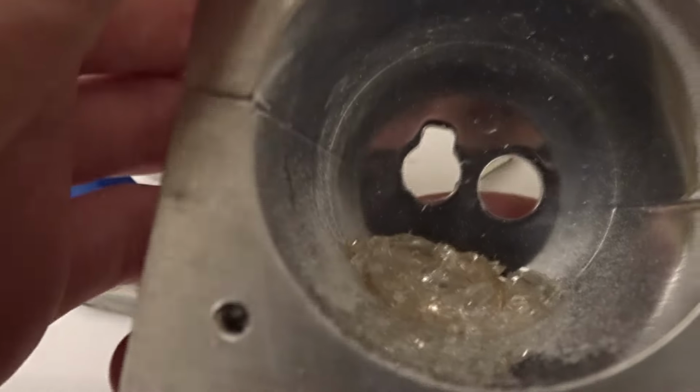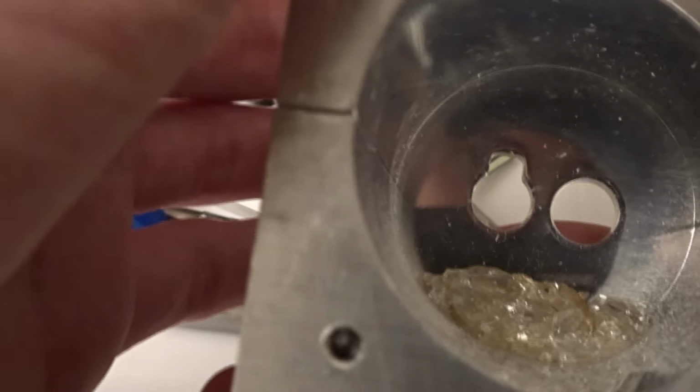What I think happened here is that I got the voltage across the tube into the kilovolt range, and it was able to arc across this conductive dichroic coating and sort of self-trigger. Now I have no idea why the rod exploded. I should have been well under the calculated explosion energy, but it was really the final straw with these tubes.